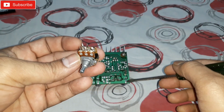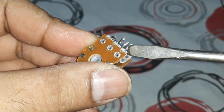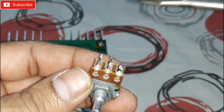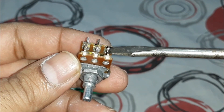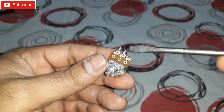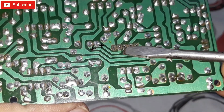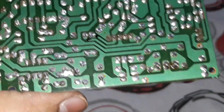The ground pins are connected to the ground of the kit. Now you need to connect the input on the left side — two pins, one for each channel — coming from the AUX cable or Bluetooth kit. Then connect three wires to the amplifier kit: one from the front middle pin for one channel, one from the back middle pin for the other channel, and ground to the ground of the kit. So those two middle pins go right here to the kit.